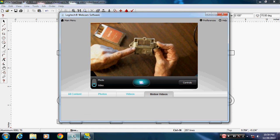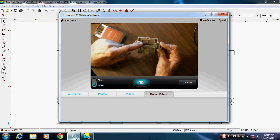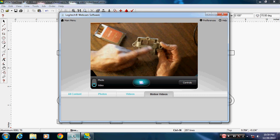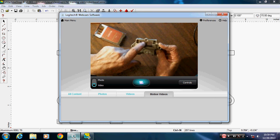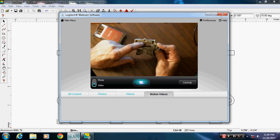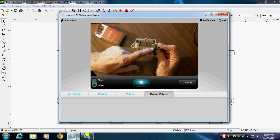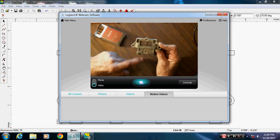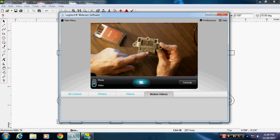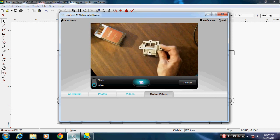So now what we're going to have is another square that's sitting right here, with the cutout in it. And if you remember what I told you before, these two holes are actually longer this way by 1/8 of an inch in the base here. So we want to draw these two holes in a little bigger than the two above it. We want to draw this in full size with this extra cutout in here. We'll just draw this as a square, and then later on we'll cut this out as a machining operation. So let me see if I can go back and do that.